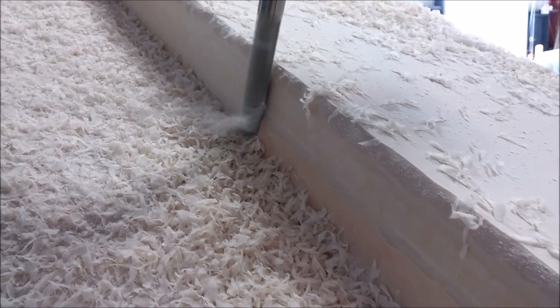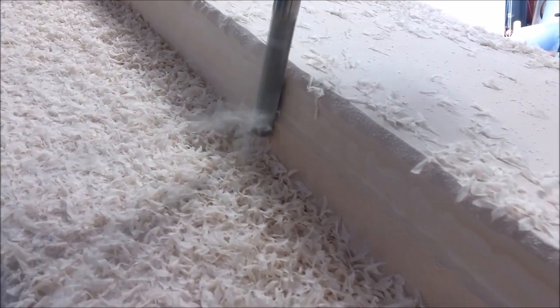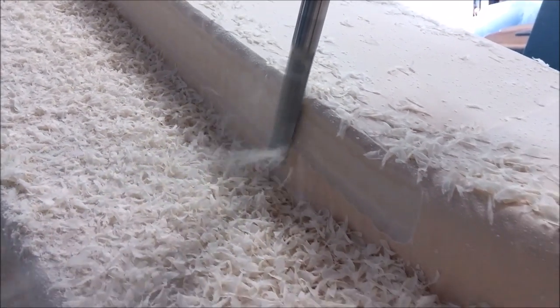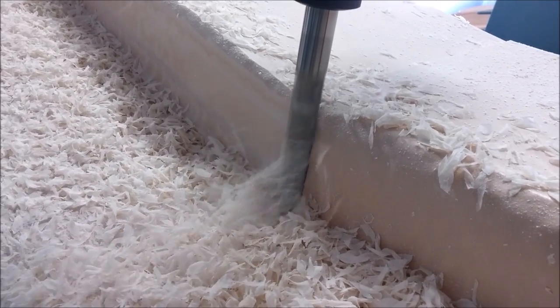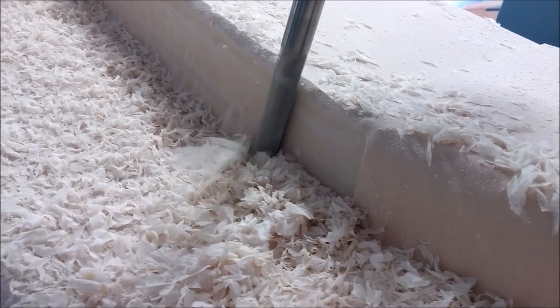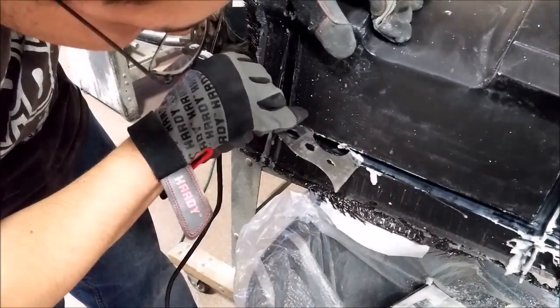You can see it's actually doing five passes — I set it up to five passes where it steps down just a little bit more than half an inch each time. That way it's not overtaxing the bit by trying to cut too much at once. Here you'll see it step down to the next level and go back up again. Those cuts came out nicely.